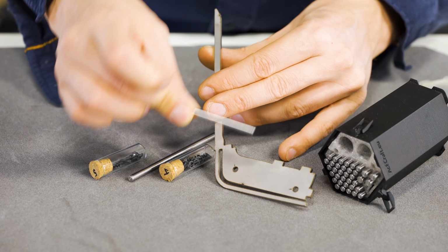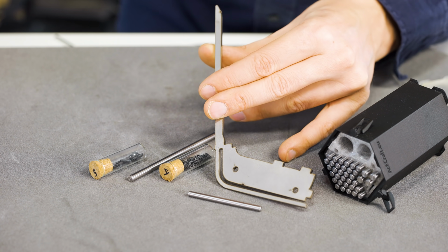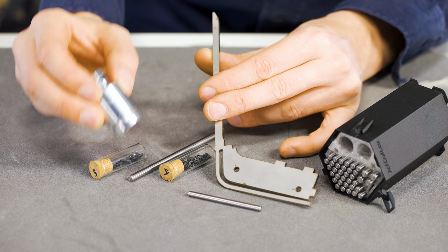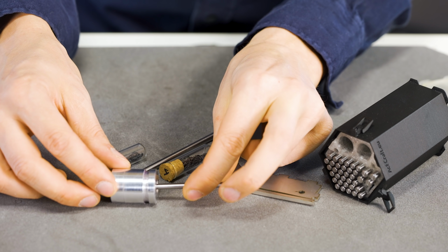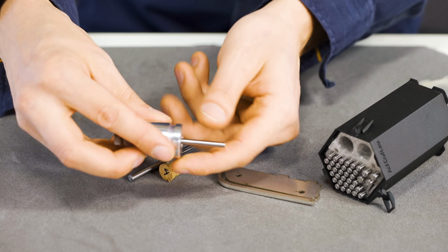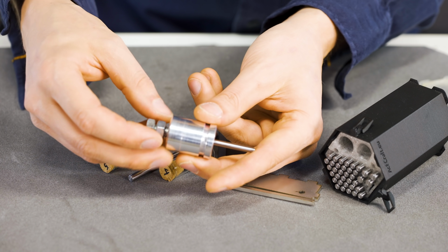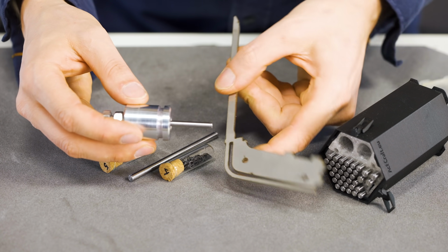fit. But I've been thinking about how to get these silicon bronze braces straight in, and me and Ace had the same exact idea. So Ace has made a jig here. With this jig, we can put the axle into this lathe jig. This jig will keep the axle completely straight, and on the backside is an adjusting screw, so I can exactly adjust how much sticks out.